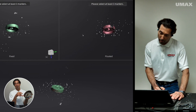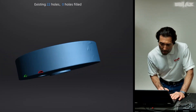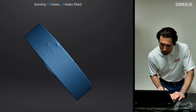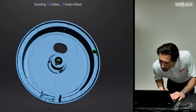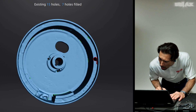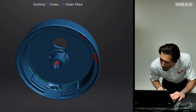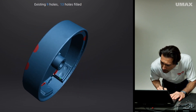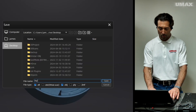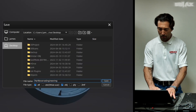After alignment, I went ahead and meshed the model. There were some holes. Because the objective was to perform reverse engineering, I wanted to make sure that the data I collected was as accurate as possible. So I did manual hole filling, going through and filling in the holes one by one to make sure that the geometry produced was as accurate as possible.